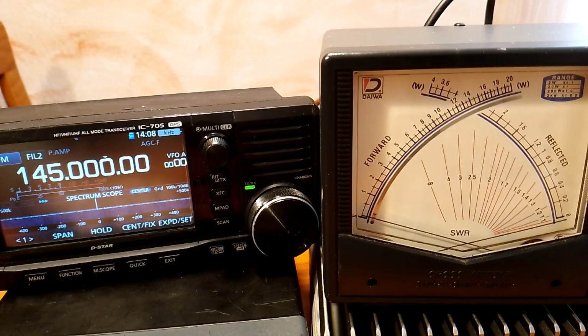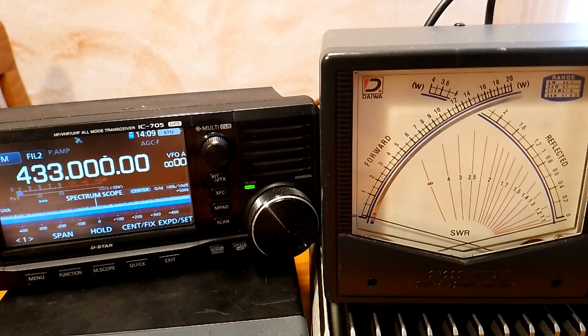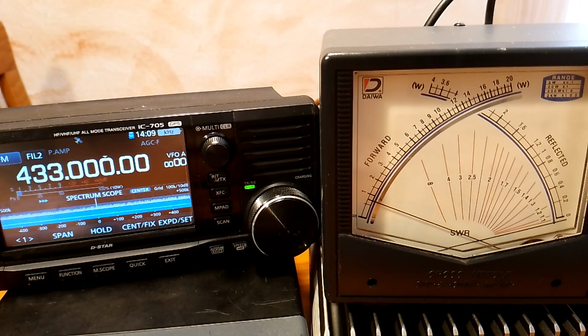little bit higher. So I'm going to power them to at 14.5 volts, so probably a volt over the range, so it is still under the 10% range, which is still safe, but of course you will need additional fans or cooling. So this is how much power can deliver at 14.8 volts. This is about it. It is about 160 watts on 2 meters. And it is the same thing on 435. It is about 145. Okay, I have a little bit of SWR out of the dummy load.